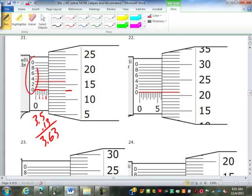What's this scale do? It just adds a digit on the end. What lines up? Well, the pink line is between 2 and 4, so that'd be 3. So 3.633 millimeters. Well, what matters is this side. This side just has to line up with something over here, but it doesn't matter what this number is. Just that it lines up. So then you just look at the left number. Yeah.